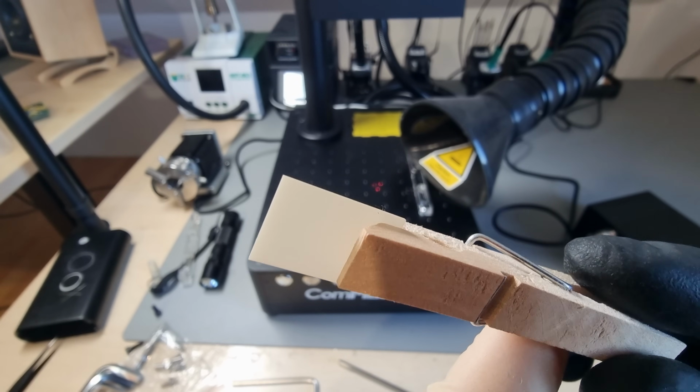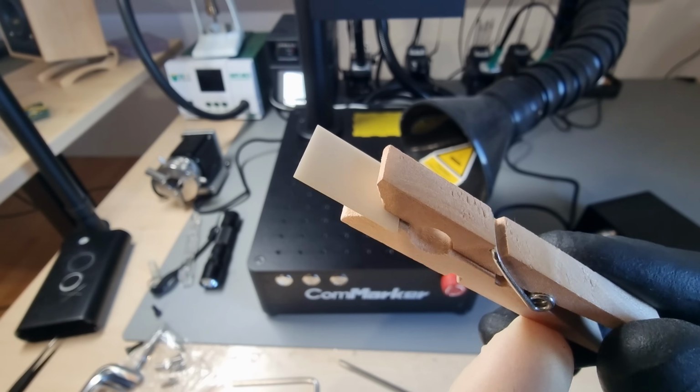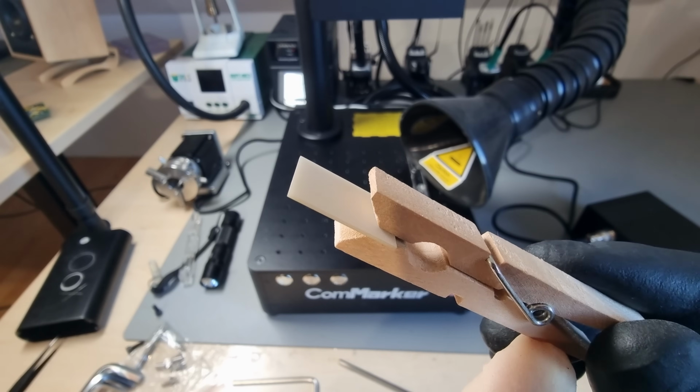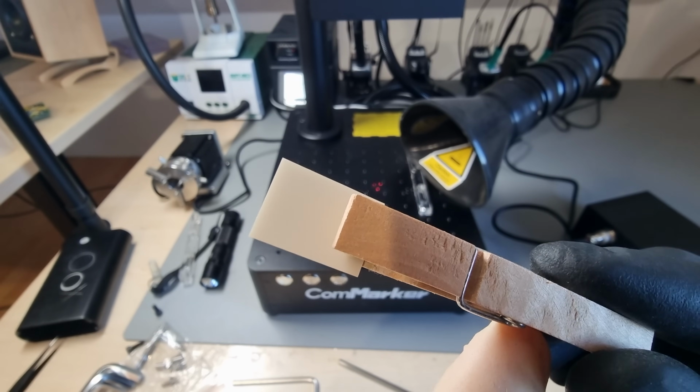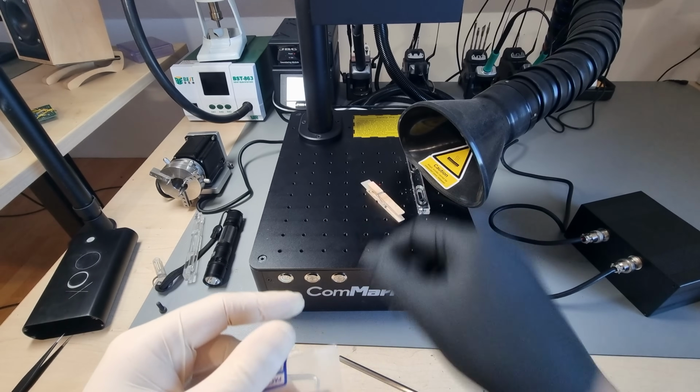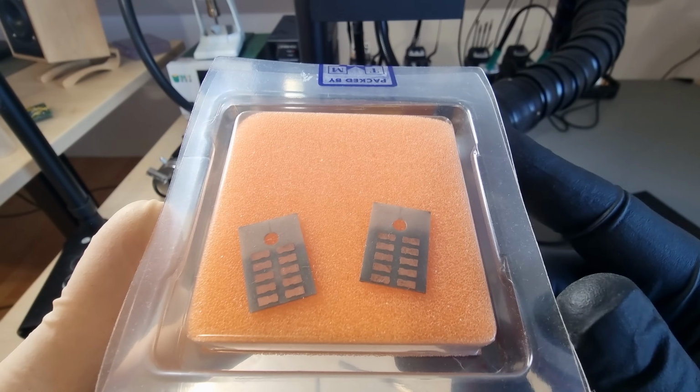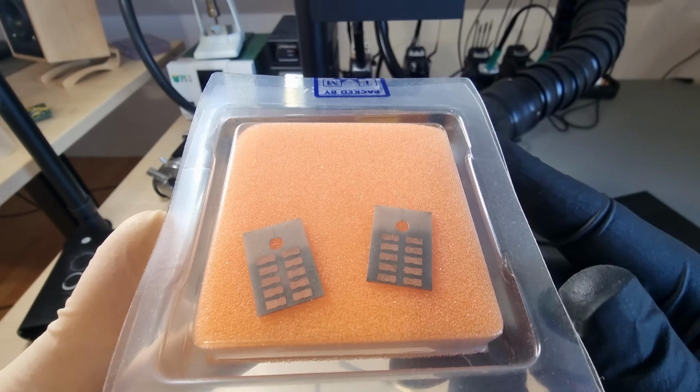This is an alumina ceramic substrate, an electrical isolator and a thermal conductor. It's interesting for microwave circuit boards and thermally coupled assemblies in DC metrology. One of my Discord server members has kindly chemically activated two and copper plated them for me, for testing as a thermally coupled resistor network.